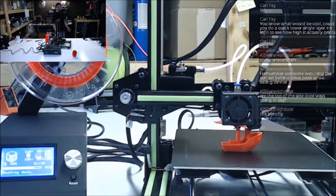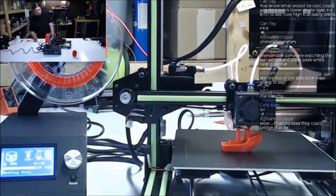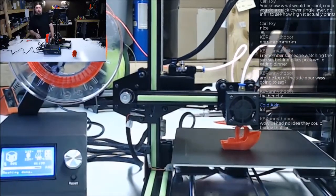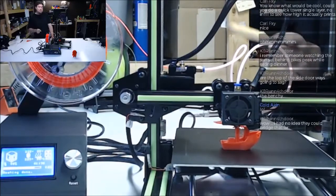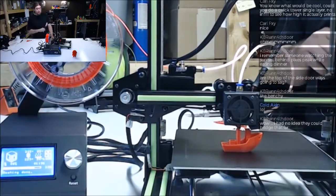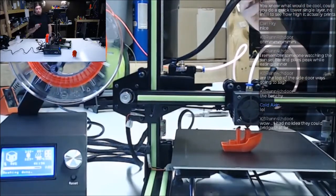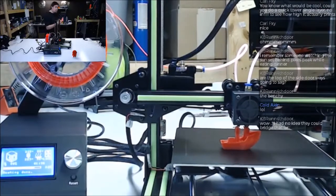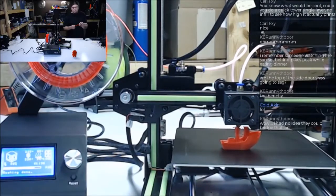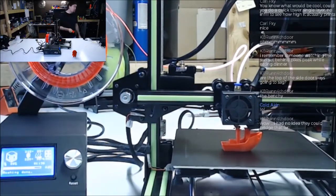A lot of that depends on the plastic. The quest. Yeah, the quest for the perfect Benchy. With the right plastic, and if it cools fast enough, it can bridge really darn far. That's 100 millimeters, and that's printing in the middle of nowhere, in air. It's amazing how well. This is PLA, and it's easy to use, but it will bridge very well. That's kind of how I judge how good filament is. If you can bridge that far, that is some good filament.